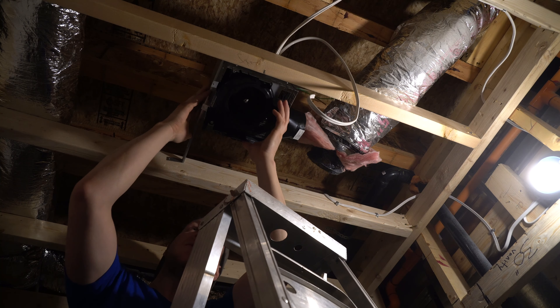For this install, you would mount it to the stud and brace. If you want it more centered, you would use that metal bracket and trim it to size depending how far you want it to sit out from the stud. After your drywall is done, grab these tabs and flip them all up — it's going to sandwich the drywall against the fan so you don't get vibration, because that will drive anyone nuts.